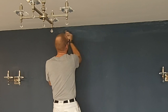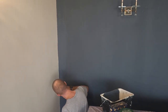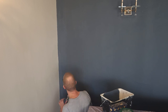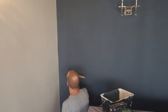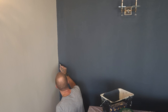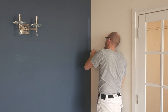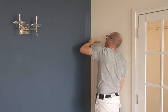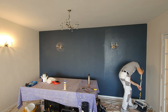As long as you've got a nice join between the ceiling and the wall — if you haven't, this can be a bit of a problem. So before I started painting this wall, this corner was in a bit of a bad state, so I had to really rub it down and I also ran some caulk in there, quite fine, just to give me a nice edge to work down. This other corner was really good and I didn't need to do any filling or preparation.